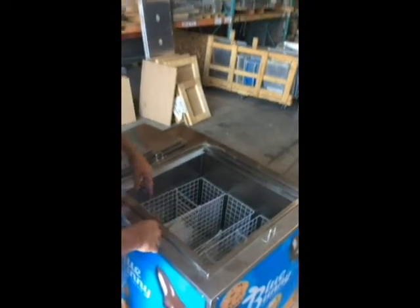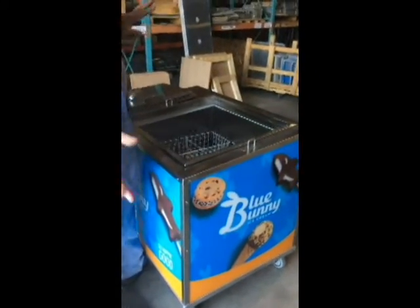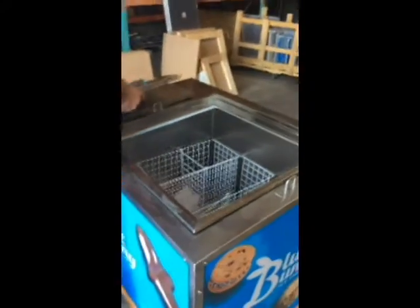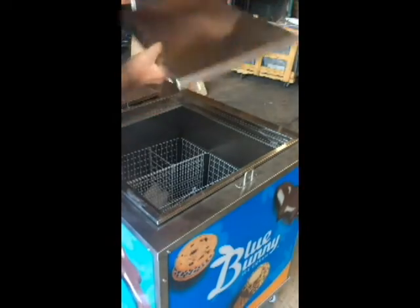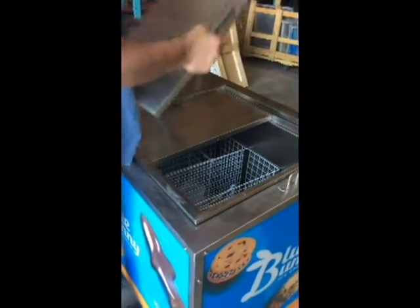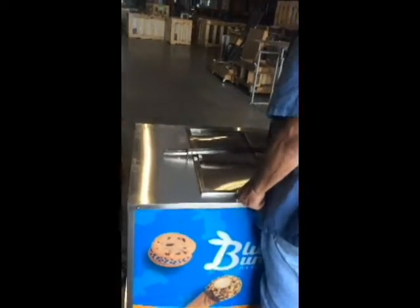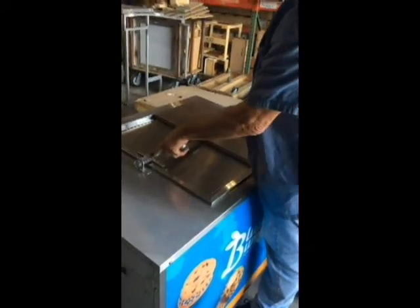Now the frame is square, or symmetric — it can go in either way, it doesn't really matter which way it goes. But note the lip high versus the lip low: this is my top lid mating here, my bottom lid mating there. So that orientation is wrong, and this one is right. It doesn't matter which way the lock bar goes, as long as you have the top lid on the top track, the bottom lid on the bottom track, and then my slot lines up.